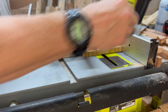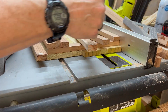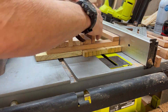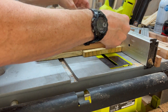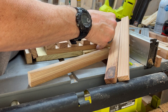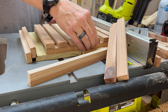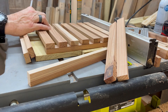Using the cut pieces I place them in to get spacing, then put glue on every piece. As you get to the end, if you didn't thin the boards down enough on the planer, just pull the spacing pieces out and eyeball them so they're all the same distance apart. Once I get them where I want them, I turn around with the brad nailer and nail them all down before starting the next row.